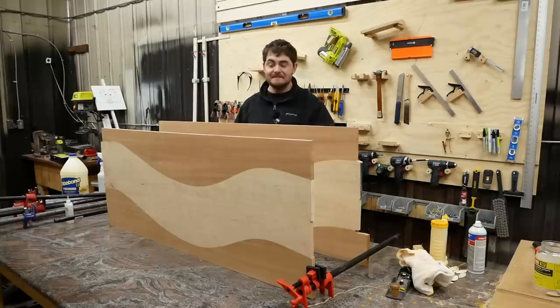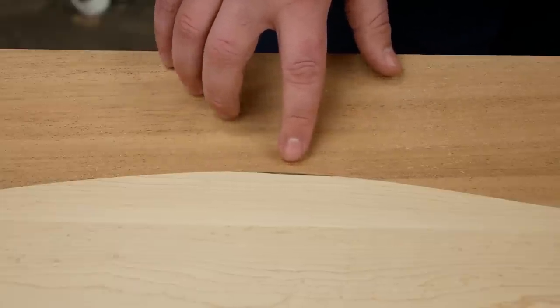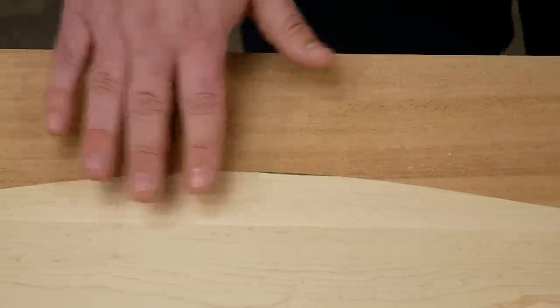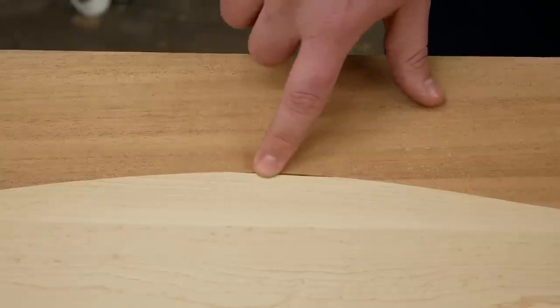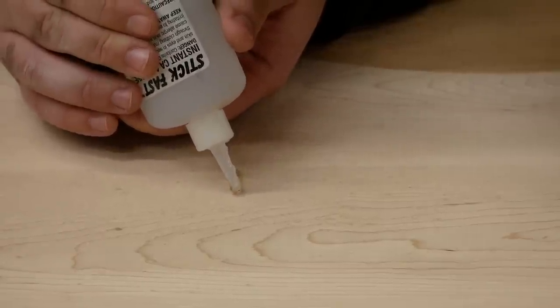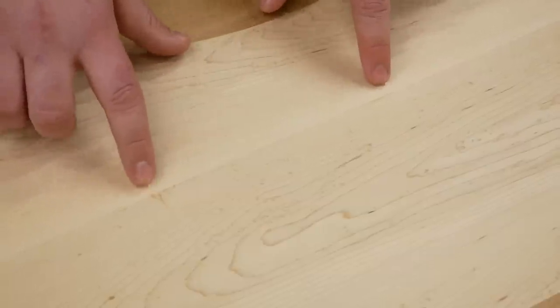Here's the nearly finished product. I think these slabs look beautiful, but I have to be honest — they're not without defects. However, I'm making this table as a gift, and what kind of manners would I have if I divulge the defects of something I made as a gift? This little crack right here is far and away the biggest defect between the two slabs. What happened is I was routed ever so slightly uphill on the maple, and the router bit grabbed hold and took a chunk out of it. This gap is much bigger on the underside, but that's why it's on the underside. I did fill it in with CA glue, but all that really accomplished was filling in the crack with something — it didn't hide it. Here and here are two places where I got a little too aggressive peeling up the wood glue, and the wood glue pulled away a little bit of wood, leaving a couple of divots. I filled those in with CA glue and sanded them flush.